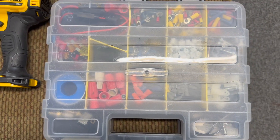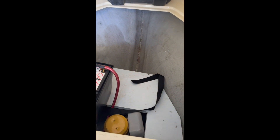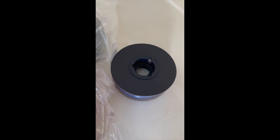And miscellaneous wire connectors, etc. Here's the space I've got to work with. You can see the forward battery. I put this battery up here to give a shorter run of wire to power the windlass on the bow, because the longer the run, the more voltage loss you have. And then you can see up under here — I should be able to get to the anchor locker through there. You're going to need to purchase a couple of things. I got this stuff on Amazon; it's pretty cheap. Some wire, obviously — the instructions give the specific sizing. Lugs, etc.